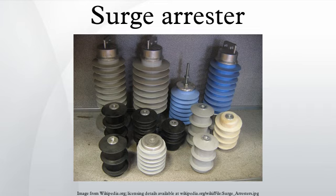The energy criterion for various insulation materials can be compared by impulse ratio. The surge arrestor should have a low impulse ratio, so that a surge incident on the surge arrestor may be bypassed to the ground instead of passing through the apparatus.